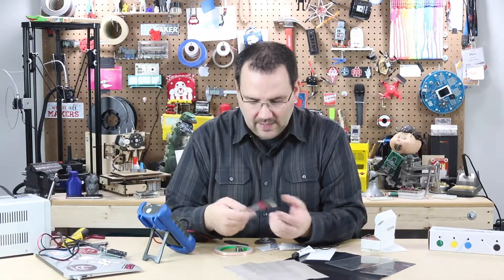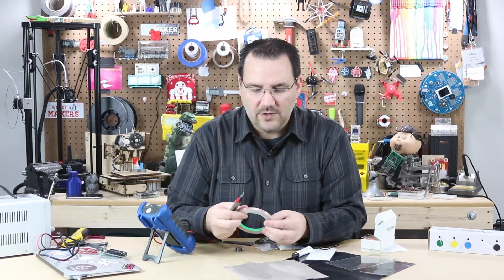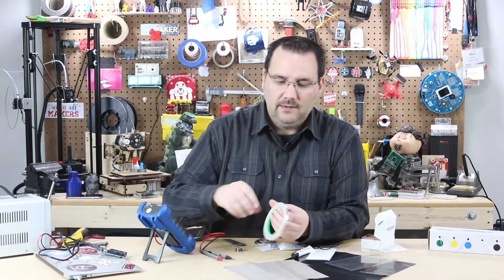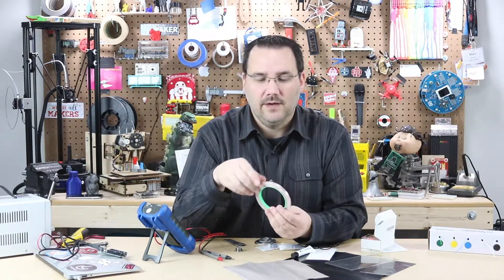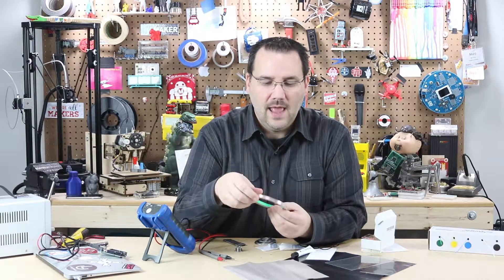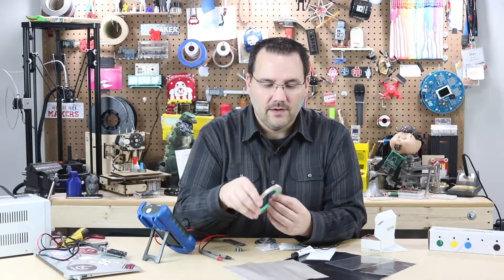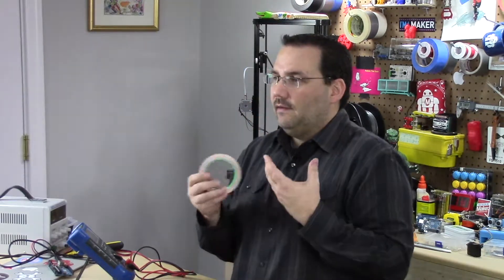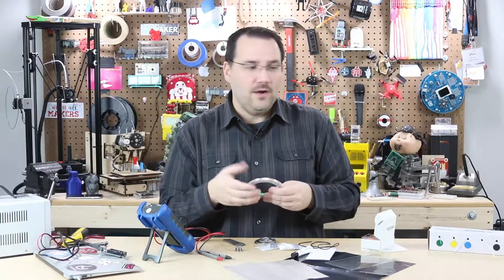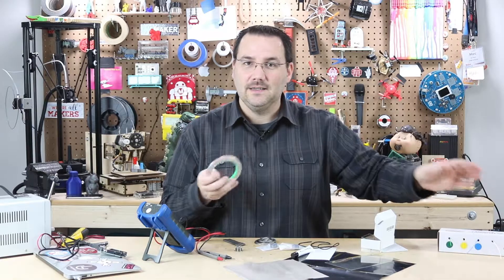Some people like to call them smart materials, but the reality is there's not too much that's smart about copper tape. You could use them in smart projects though. Copper tape is adhesive-backed copper foil, and it allows you to make soft connections between devices. It's very popular in wearables, paper prototypes, or somewhere where you need to sneak in some very thin wires. And it's conductive, as are all of the things I'm going to show you in this video. This is meant to inspire you to think about how you can replace standard wires with other conductive materials.